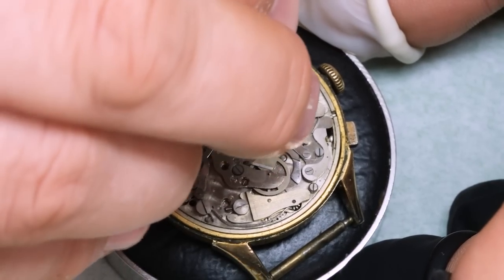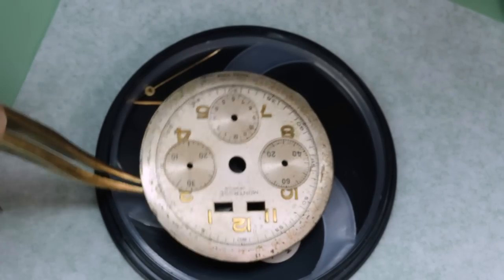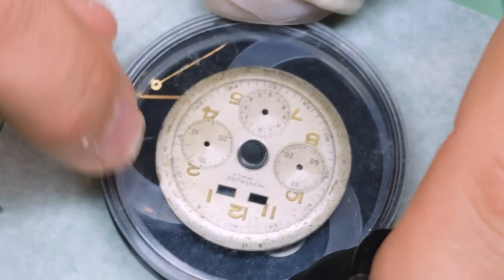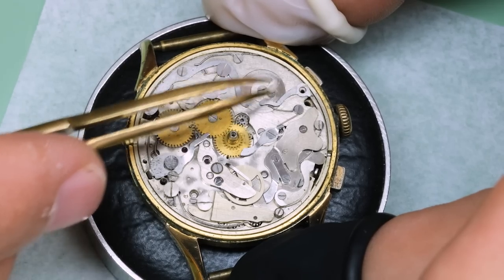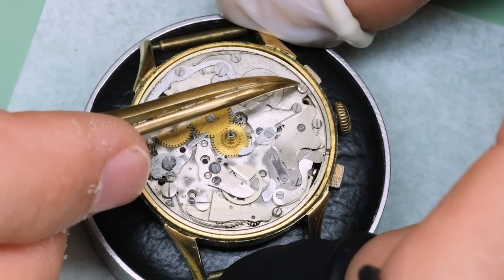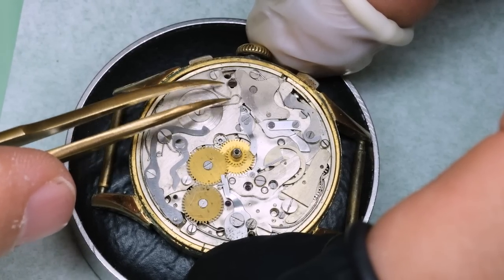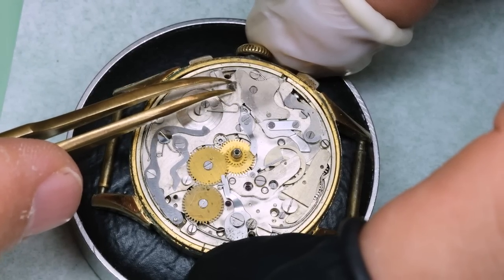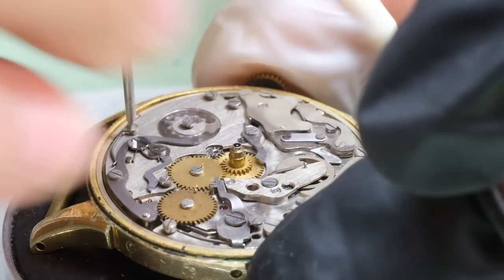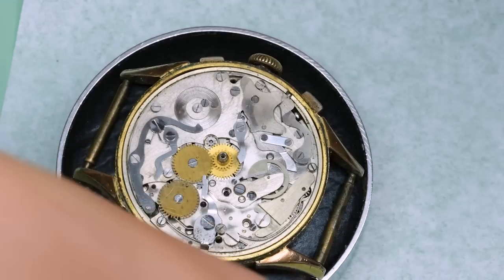Let's take the wheel discs off and put them together with the dial in this little protection box. There are a lot of screws in these old movements and it's a problem that they're actually not identical, even though they might look identical. These old movements have a lot of shoulder screws. Instead of trying to keep track of them we simply put them back in place — that way we reduce the risk of mixing up screws quite a lot.